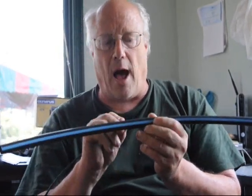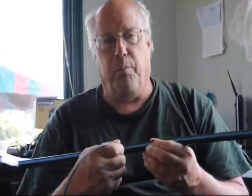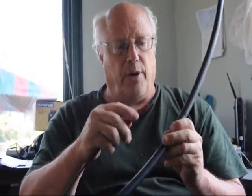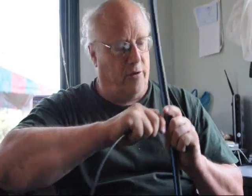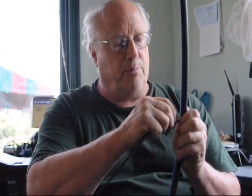Now you can put one on the opposite side of the blue stripe pipe or on the actual part of the blue stripe pipe. The way you put your hole in the blue stripe pipe is you take the pointed end of your sprayer and you just push that into the blue stripe pipe. Bingo, like that. Goes in very easily. It makes the hole. Then this nipple is inserted into the hole. It just pushes in.